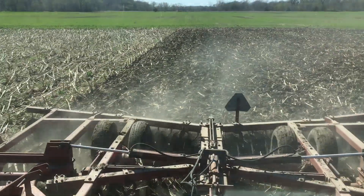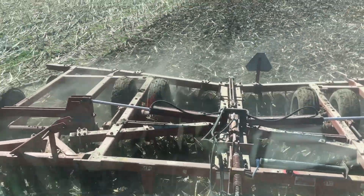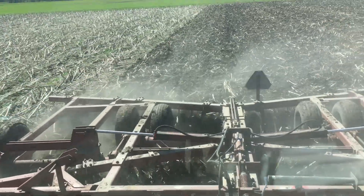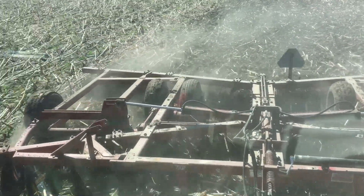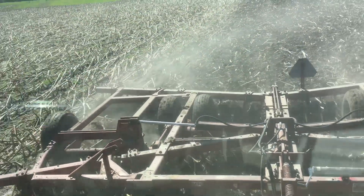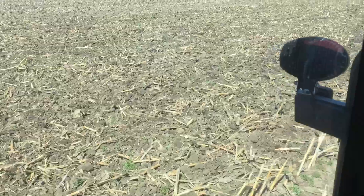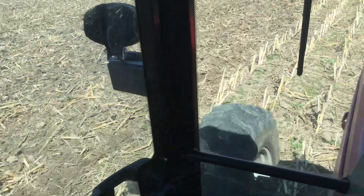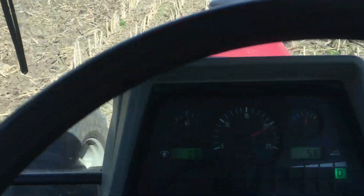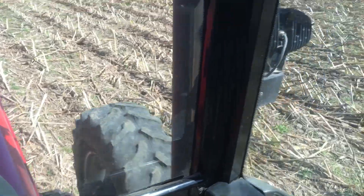So that is what we are wanting to see. We're not trying to go insanely deep — we're actually going pretty shallow, about three and a half, maybe three inches. But we're maintaining speed, we're cutting down the ridges, we're leaving the field relatively level, smoothing it off so it won't hold water. We're leaving bare soil so that will dry out good. And there's a shot of the speed.